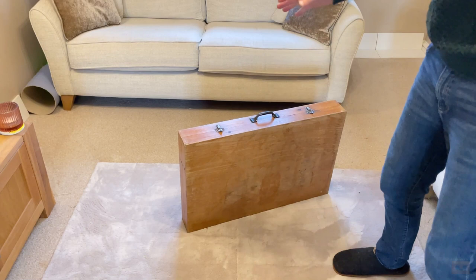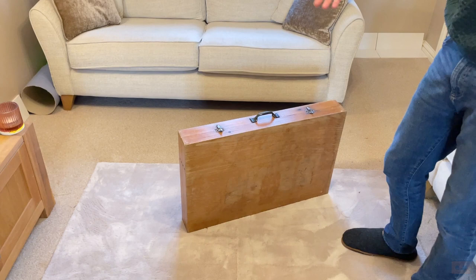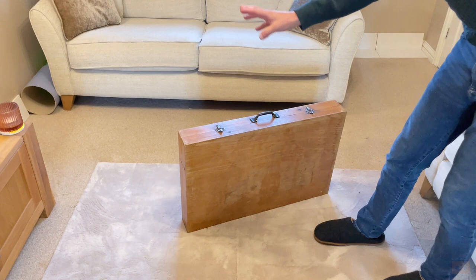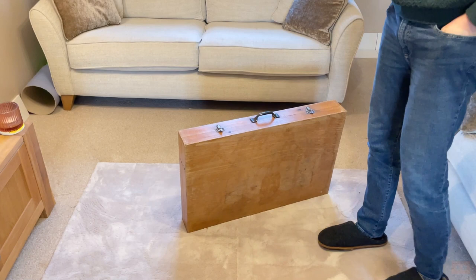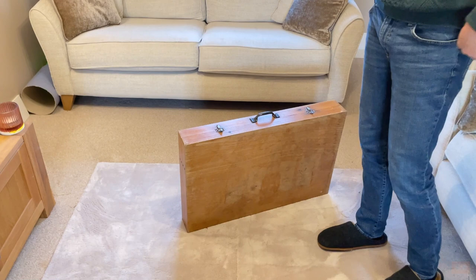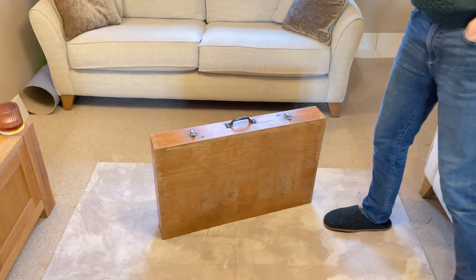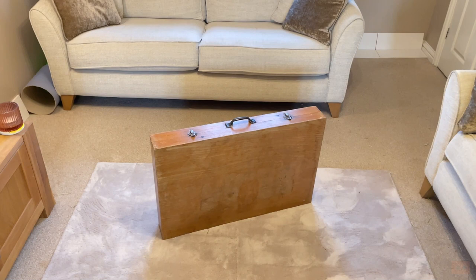In summary, that's the vintage 1950s to 1970s pop-out table with four chairs. I've cleaned and waxed the wood, removed the embedded corrosion from the metal clips, polished and waxed them up. On all the chairs I've replaced the old frayed canvas, stitched around the outside, and made new green webbing ones, re-tacking them in with furniture tacks. Bits to mention: there are a couple of small pieces of wood missing from the base, and a couple of extra loops in the webbing stitching, but it's a really nice, unique vintage item. If you like the video please like, subscribe, comment, and share — it really helps grow the channel. Take care and see you next time.